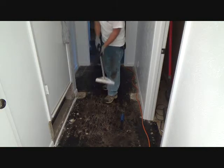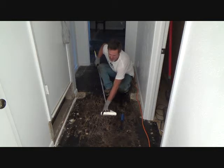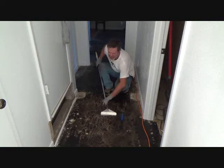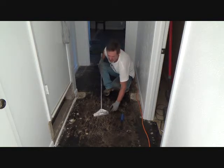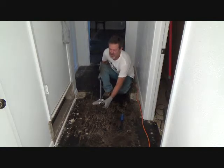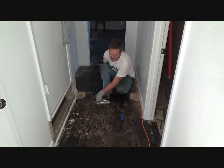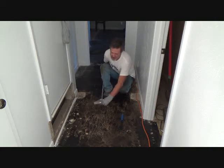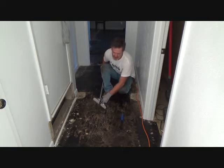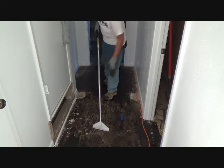Here's one more thing to think about. On this blade, I'm flipping it — basically using this cutter edge from mid-section or a third over in this direction. When I flip it over, I'm still using this end of the blade on the back side because it's double-edged. So once I figure the rest of this is pretty dull, do I have to throw this blade away? No. I'll take this blade out, flip it around, and put it back in. Then I can use this blade effectively from here over on both sides, just like I am over here for this particular floor.